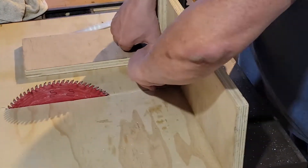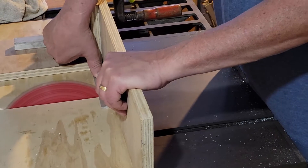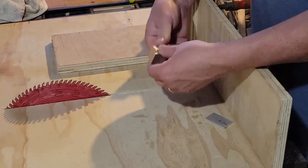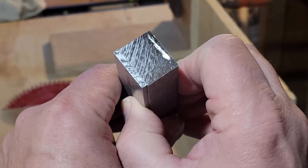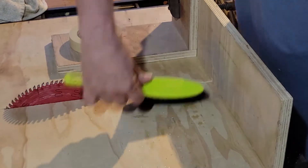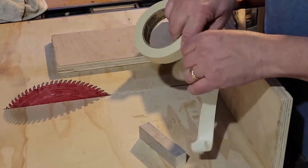There could be two or three or more layers of caulking and silicone, and when I go to remove it all using just a utility knife, I end up finding gaps — because the old caulking had leaked a little — leaving some spongy drywall. What I need to do is add some plaster onto that, and once it dries, sand it down. It's a very tight little spot to try and sand.